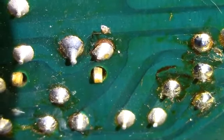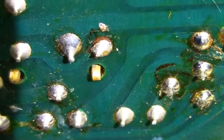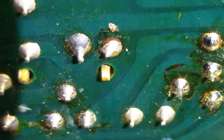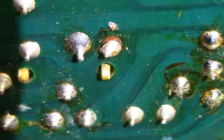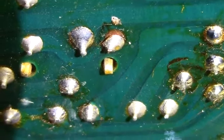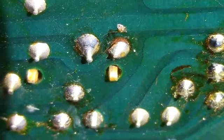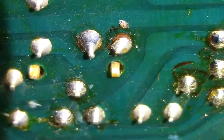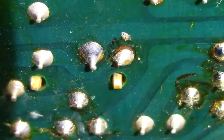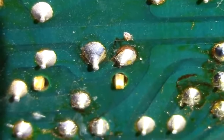Well, hello there. I think I might have found a very probable cause for at least one burnout. That is indeed a pad for one of the driver transistors' emitter resistors, and that's fallen clean off. Now, this is one of the devices which failed in the original failure of this amplifier, so this might have been lurking around for quite some time, because that's an obvious failure. It was just stuck down with some flux residue, which I must have missed all the other times.